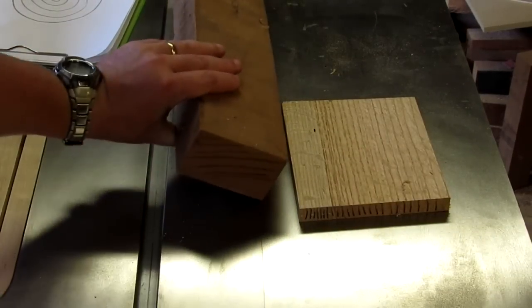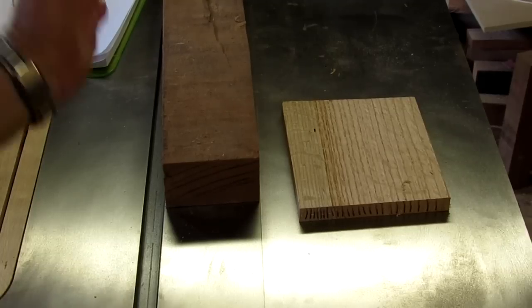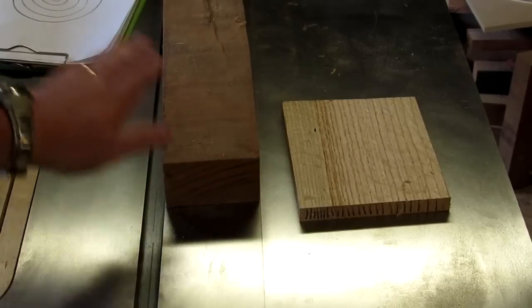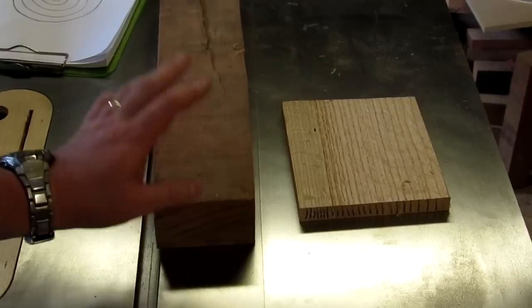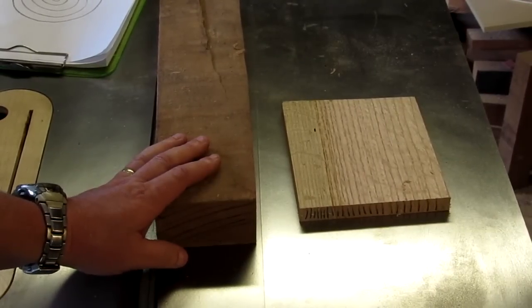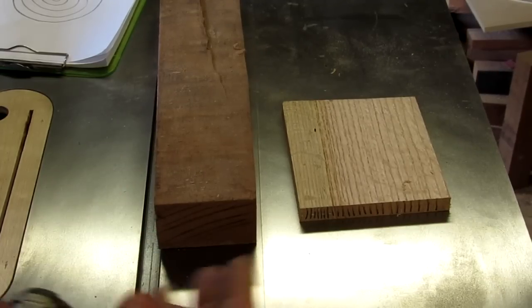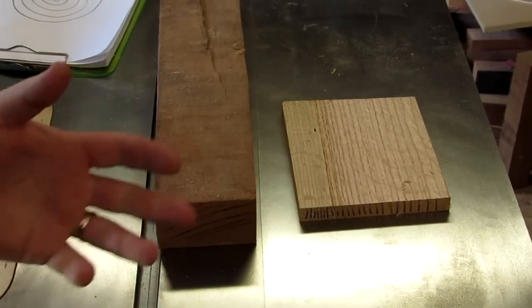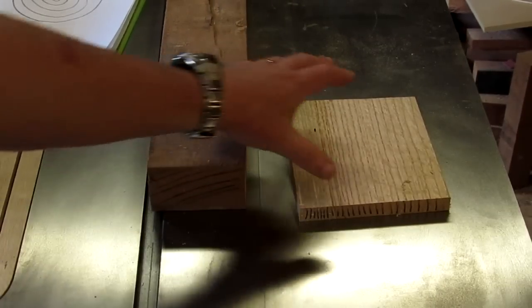They really don't orient the wood, but cut in one direction. A lot of times they'll cut a square out of the log, and then they'll just start slicing and slicing and slicing until they get all the way through the log. This is what most lumber is. Most lumber is plain sawn. It's cheaper, but one of the disadvantages is that it's not as stable. It has a tendency to want to cup and check as it dries, so you have to be careful with plain sawn wood.